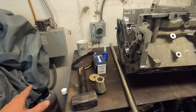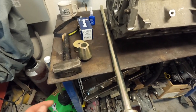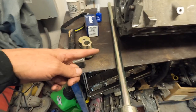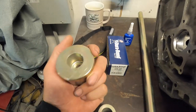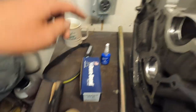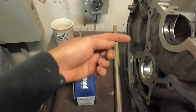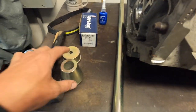A little movie magic and we got all our supplies here. I've got the cam bearing boomstick — this is a cam bearing install tool specifically for an LS. On the end there's no threads. Some of these actually thread the mandrel but this one just slides in, captures it, and you give it the old wackaroo. It's nice because you can just take this off and on, so it's quicker and you don't have the threat of any threads when you're sliding it through and contacting your new bearings.